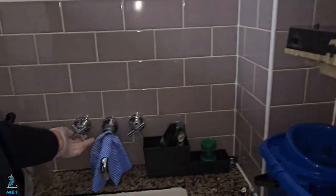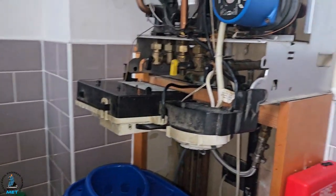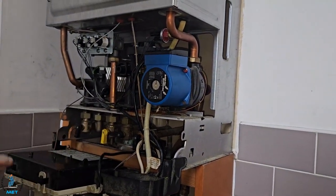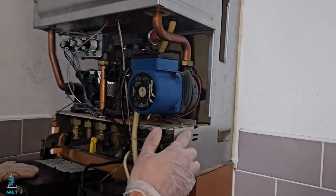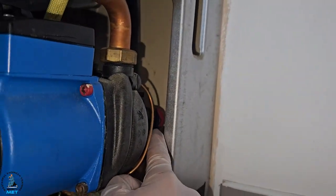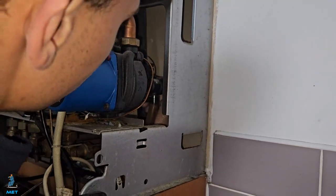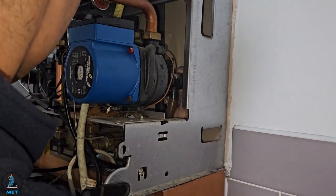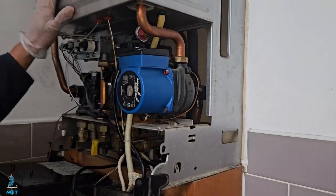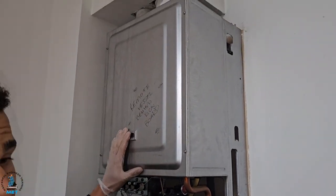Open the hot tap just to make sure it's off — no water's coming out. There's no drain-off on this boiler, so we're going to have to do it from the PRV. If you can see that red valve around here, I have to stick my hand up and open it. Then we pressurise the expansion vessel to get any excess water out.